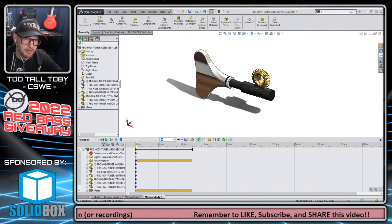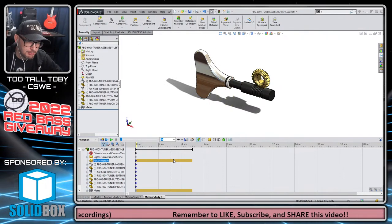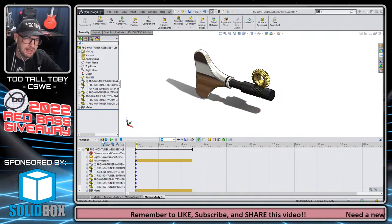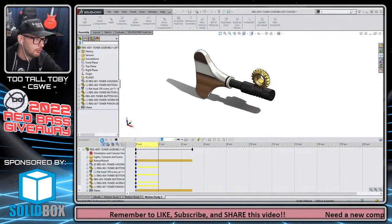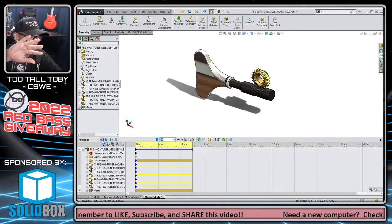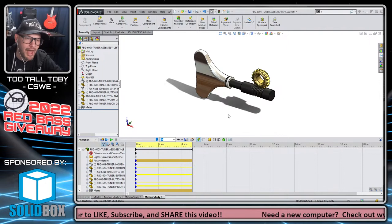I hit the green check mark, and SolidWorks adds in this motor. It's going to start here at the 0 second mark and go out to 4 seconds. So I'm going to say calculate, and SolidWorks is going to go through and calculate that motion assembly. It's pretty choppy in my opinion. It's very like, well, why is it so choppy?